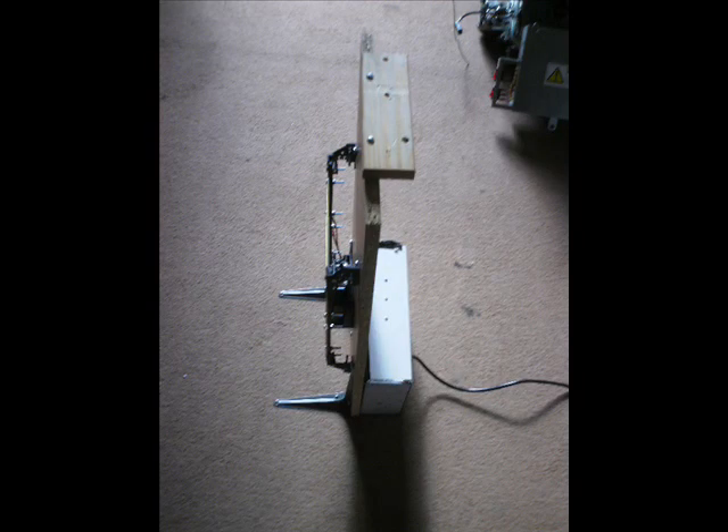914 charging by beaconing and odometry. We start off with a charging unit. It has two vertical charging plates and features an infrared homing beacon. It can provide up to 5 amps, which is enough to charge the batteries and power robot electronics.